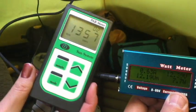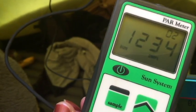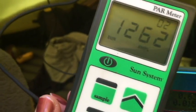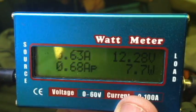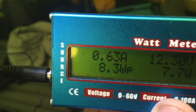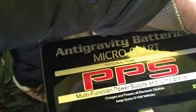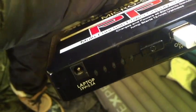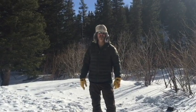With the 30-watt PowerFilm set up on the tent, we're getting about 1,200 to 1,300 lumens with a PAR meter, and it's in full sun. With that, we're generating about 7.7 watts — 12.3 volts and about 0.63 amps. That's about what this anti-gravity battery MicroStart will receive, and you can see it is definitely charging. If you learned something from this video, please like it and subscribe to my HangTough Survival channel.